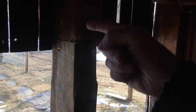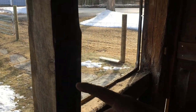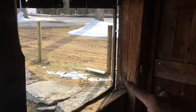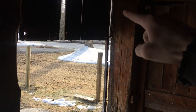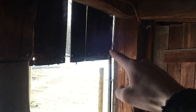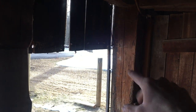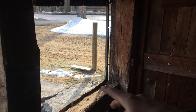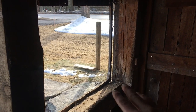So now that this 6x6 support is in here, the width of this opening is just a little bit wide for the window. So all I'm going to do is cut a 2x4 to fit against that post and then cut the window header and we'll call it good. It'll be a little bit wide — like a half an inch wide for the rough opening — but that'll be fine.